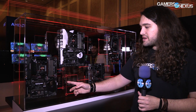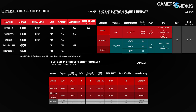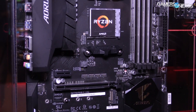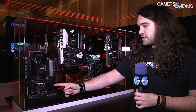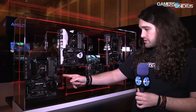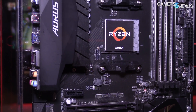Getting to the board: the X370 chipset will have a chart on screen with some of the base IO you can expect, covering USB 3, SATA Express, and things like that. Before getting cynical about SATA Express, there's actually a reason to have it — you can peel off those lanes and use them for something else since SATA Express is driven on the PCIe bus. The board has an x16, an x8, and an x4 slot. These three PCIe slots, even though they're full length, are wired electrically for 16, 8, and 4. If you look closely above the first PCIe slot, there's a set of four chips — which we also showed on the MSI X-Power Titanium — that can mux the signal for additional video cards.